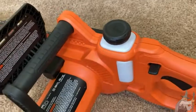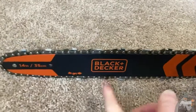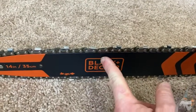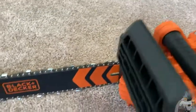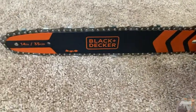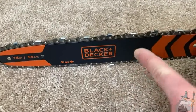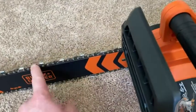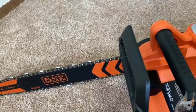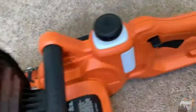Read all the directions. One thing that's not talked about enough: you want to make sure you don't put the blade in the sand. You can see how it's tipping over and hitting the carpet — if this were outside in a sandy area, you could get sand in your blade. It's generally not good; it wears down the chain when you do that. So you want to keep your saw out of the sand as much as possible.